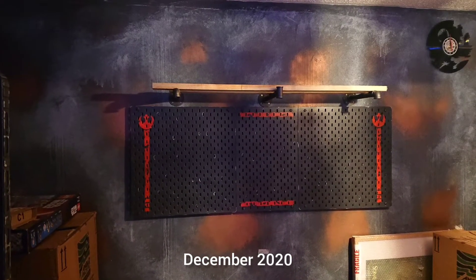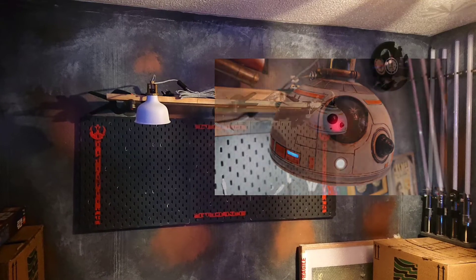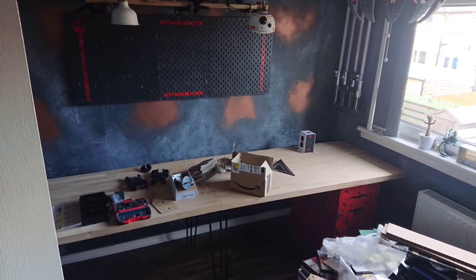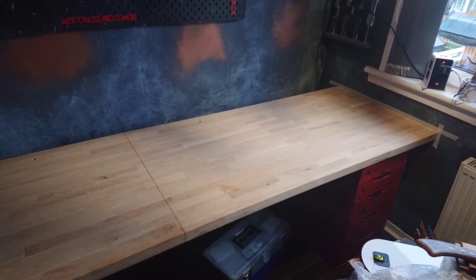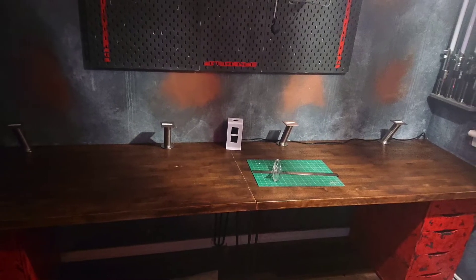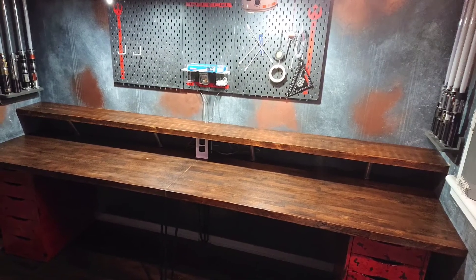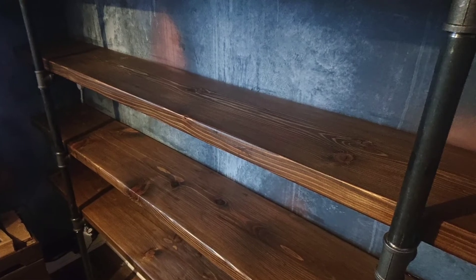So while I was waiting for the worktop to arrive, I got the pegboards on the wall, brackets for the shelves, and the lights all sorted out, including my reused BB-8 light. Then the worktop came — it was 3 metres in length, and unfortunately I had to cut it in half to actually get into the room, but once it was in the room it was fine. I added in some hairpin style legs in the middle just to give it a wee bit of support where it's joined together. I then went on to stain it a dark Jacobean oak, just to match the shelves, then gave it all a Danish oil finish to give it a bit of protection. I put the shelf on and the desk was done. I love how it's turned out — it's perfect for what we need. I did then have to go back to the shelves and finish them off with the same Danish oil finish, but after that was done, they looked great as well.